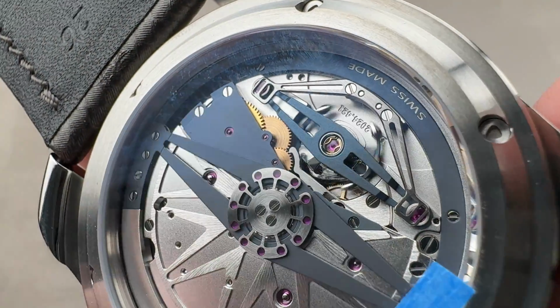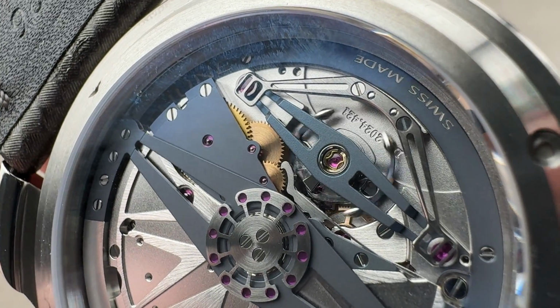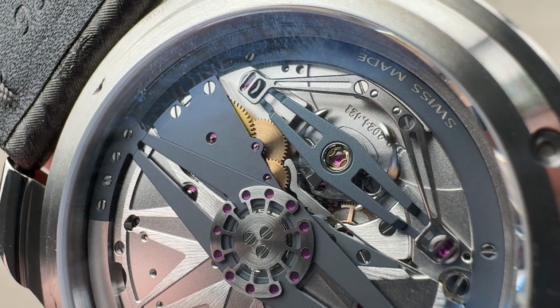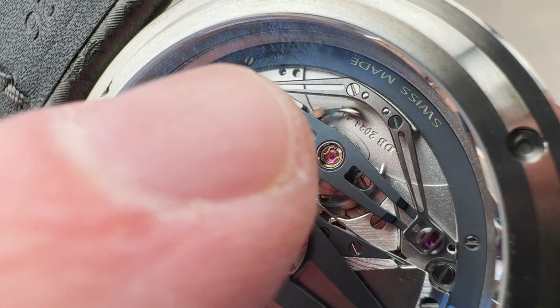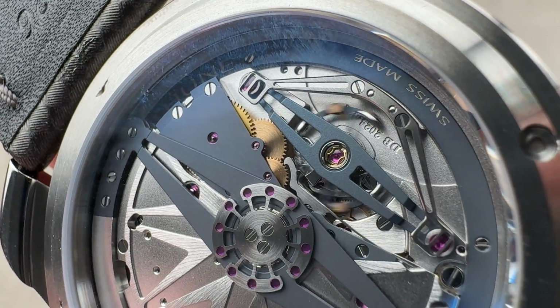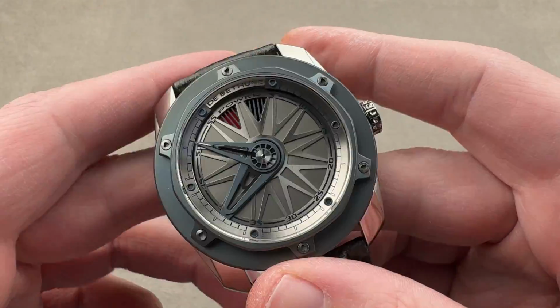Then you can see de Bethune's patented hairspring profile. It's a flat hairspring, but you can see because of the dog leg kink, it breathes concentrically due to centered mass, the way an overcoil would. So it has the best advantages of both a flat hairspring and an overcoil. It's actually 2 pieces of metal cut in half, clamped back together after hand shaping, and it is one of de Bethune's many patented innovations protecting this movement.